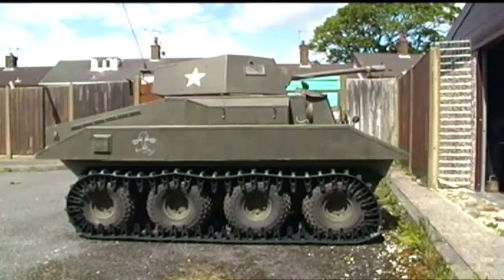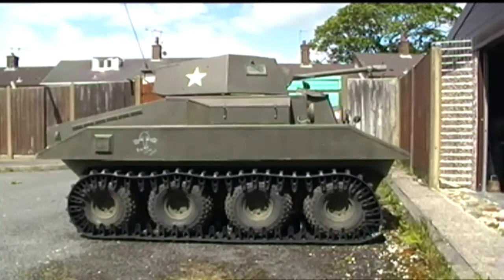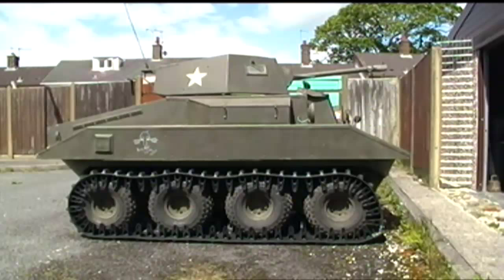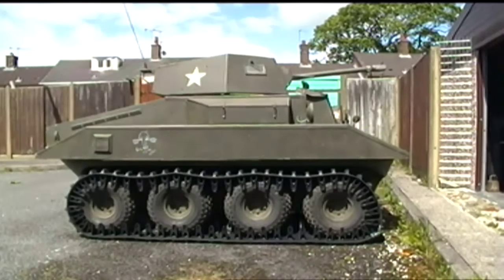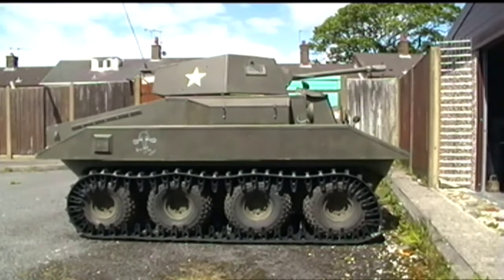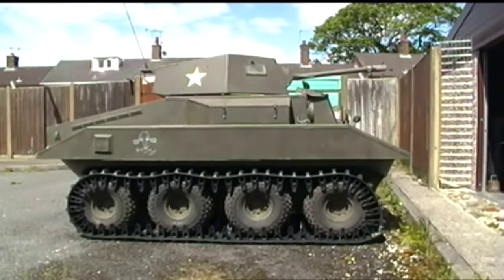I've actually got silicone brake fluid in it at the moment, and even that doesn't seem to help. It still goes a little bit poor on performance. I think I've even got Kevlar brake pads in to improve performance on the disc brake. Anyway, it looks like I need to do a little bit of maintenance on the hydraulics before I can do any real testing of this.